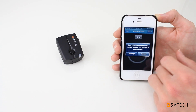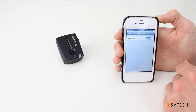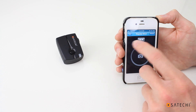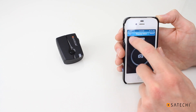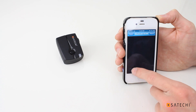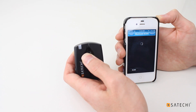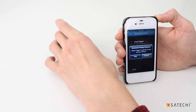Let's open the smart trigger app. It will ask us to turn Bluetooth on, so we'll go to the settings and turn Bluetooth on. Then if we go back to the smart trigger app, this icon that it displays here — when it's gray, it means the smart trigger app is not connected to anything; when it's red, it means it's connected to the receiver. Let's touch scan. This is the Bluetooth scan menu, and to start scanning, we'll touch the button in the lower left. To put the smart trigger receiver in pairing mode, just hold the button on top of the receiver for about four seconds, and then the app will ask you if you would like to pair.